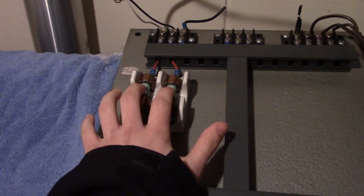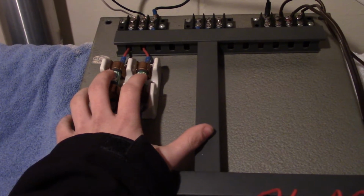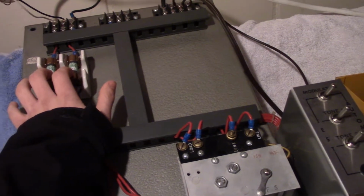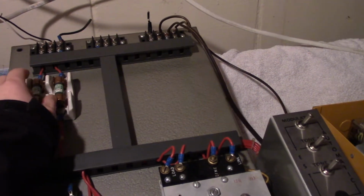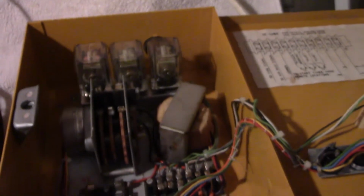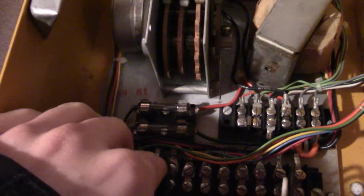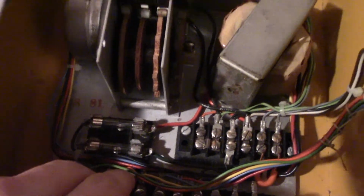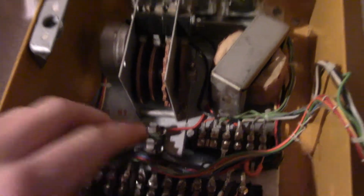These are the fuses from the RCM1, because I thought the ones that were in here were bad because it wasn't working, but I'll throw them back in here in a minute to see if they really were bad or if I was just being stupid. Which is probably me being stupid, because that's usually more often than not what the problem is. Earlier, I was trying to work this thing off, and if you know anything about AF timers, in order for the test button to work, if you're running a normal siren like a Model 2 or something, you have to have a jumper between 1 and 2. So I had a jumper there, and this wasn't working, and I was like, okay, what's going on? Then I realized that I had a jumper in there, and it was probably causing something to go haywire, and that's why it wasn't turning on. Pulled the jumper out, fastened down all the wires right away, powered her up, turned her on, worked like a charm, like you just saw earlier in the video.